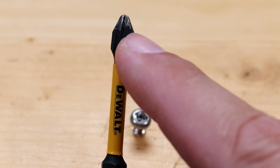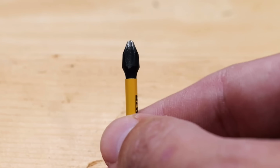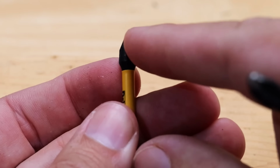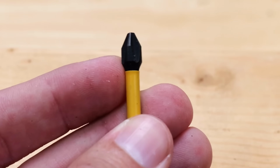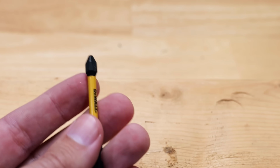It's going to probably be worn down like this one is here, and even more likely that you're going to strip those screws out. So you want to be paying attention to the bit that you're using. Make sure that you're using one that you do not see that it's been rounded off at all, and you'll be able to tell because they'll slightly slope down as you get further out to the tip. So definitely make sure that you're buying quality tips for your drills.